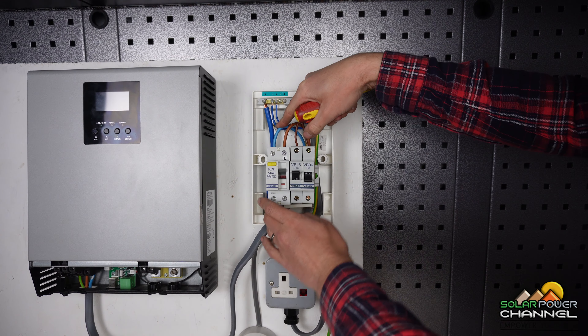Quickly — the difference between RCD and MCB. The RCD is what we connected to first; it monitors what current goes in and what comes out. If the two don't match it trips — super handy. If someone is getting electrocuted or touches a bare cable, a bit of current has gone through them, the RCD notices the imbalance and trips. The MCB acts like a fuse: if you short-circuit something or there's a high load, it trips to protect the cable from overheating and causing a fire. The MCB is essentially a resettable fuse.